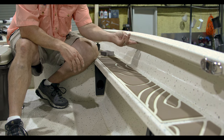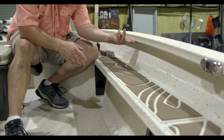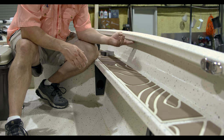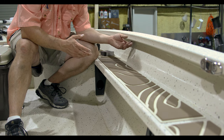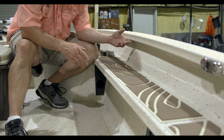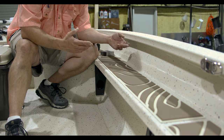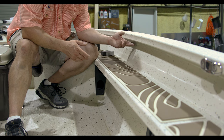So you must periodically, I would say 3 times during a day for 2 days, go and firmly press and make sure that it's adhering. As that heats up, heat is good for the adhesion. Cold is very bad. Aluminum boats seem to be worse than the fiberglass styles, but if your boat sits out overnight and it drops to 40 degrees and then the next day at 9 o'clock you try to put them on, that aluminum still will be pretty close to 40 degrees. The snake tubes are not gonna adhere very well to that.